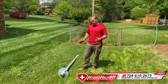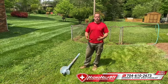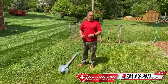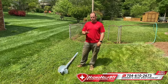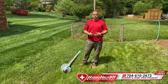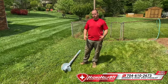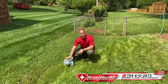I just wanted to show y'all and talk today a little bit about what helical piers are. What you see laying in front of me is a seven foot helical pier. It is basically a two and seven eighths inch galvanized steel rod that has what they call a helix on the end, and you'll see me show you this in a minute. The purpose of these are to repair residential houses that are settling uneven, sinking, or falling down in certain areas. Here in the video you can see me touching the helix.